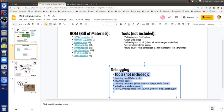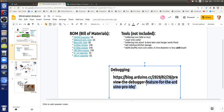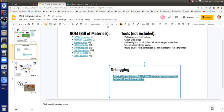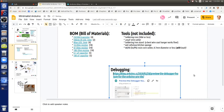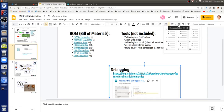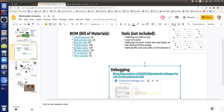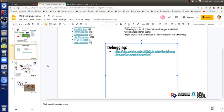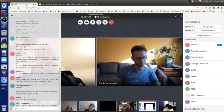On your hardware on the board, you can add an extra LED with an extra wire on another output pin, and that output pin can be lit whenever something happens. Then you can tell if that part of your firmware, your controlling program, is reached under certain conditions.